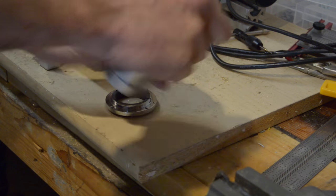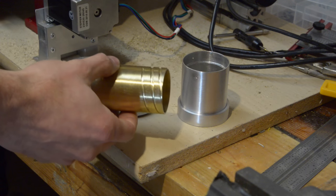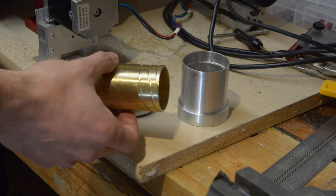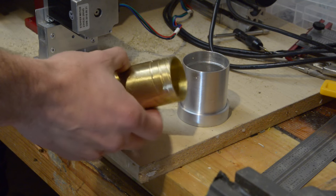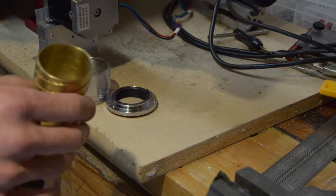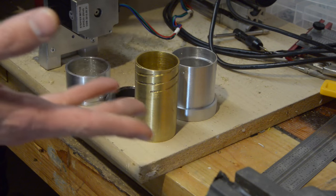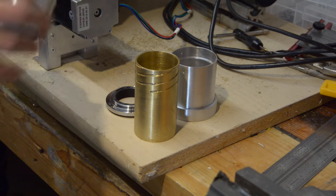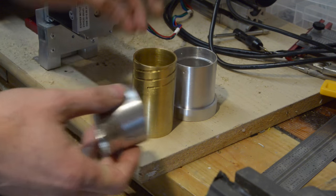If you imagine there's a lens in this inner barrel here, and you want to have an object at infinity, you'll have a lens like that. If the object is closer, you move the lens back and forth to compensate. I've made previous lenses and the easiest way to do that is with an inside barrel and an outside barrel that you just slide back and forth. That works okay, but it's kind of janky — it doesn't feel good in your hand. What you really want is to rotate an element and have that rotation translate to a translation. So that's what I've got set up here.